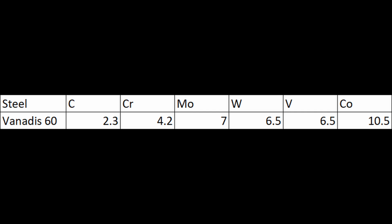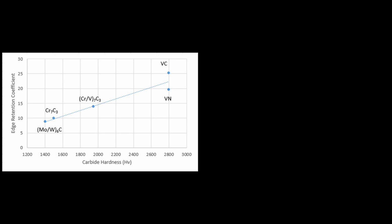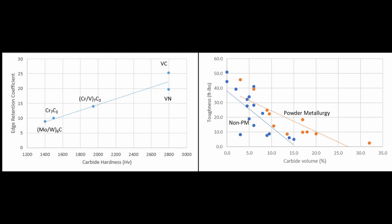The toughness and wear resistance of high-speed steels is largely controlled by the carbides. This steel has a lot of molybdenum, tungsten, and vanadium, so it will form some M6C carbide — those are carbides formed primarily with tungsten and molybdenum — and MC carbides, where the M is primarily vanadium. Vanadium carbides are more desirable because they are harder and smaller than the tungsten/molybdenum M6C carbides. The vanadium carbides are less detrimental for toughness because they're small, and they also contribute more to wear resistance. So a smaller amount gives you more wear resistance, and usually means more toughness. We want to balance steels by having primarily vanadium carbide.